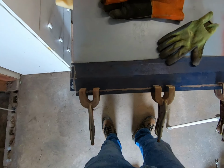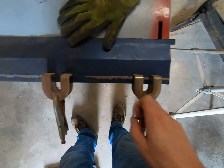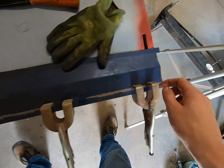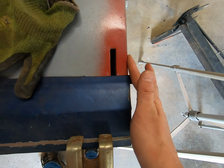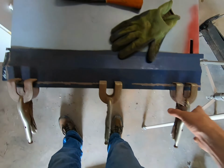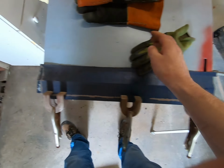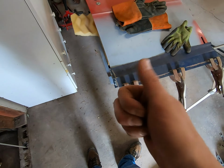So my remedy for that is to draw this back at least an 1/8 of an inch, reclamp it to the door shell, and start wrapping this down again, okay? And I have this plane hanging out a little further than here. That way, when this wraps a little too tight, and I loosen these clamps up, I can actually shift it, and it should fall close enough to the edge of this and the edge of this, so it's not too wide and not too narrow. You dig?